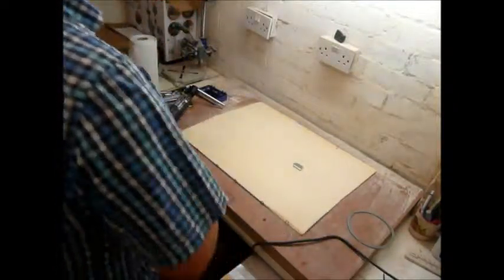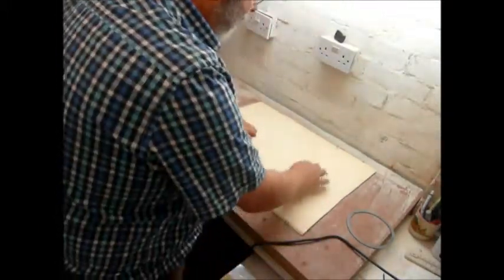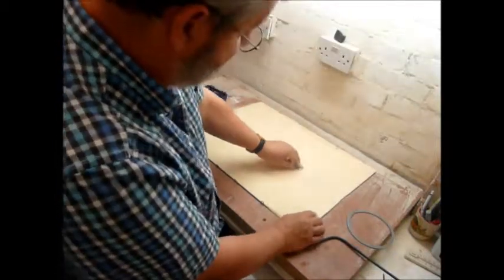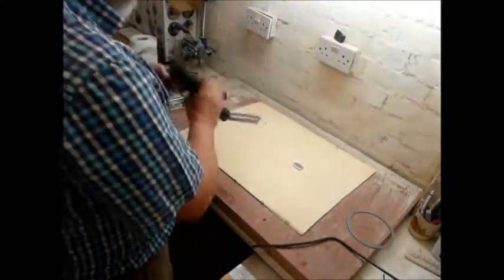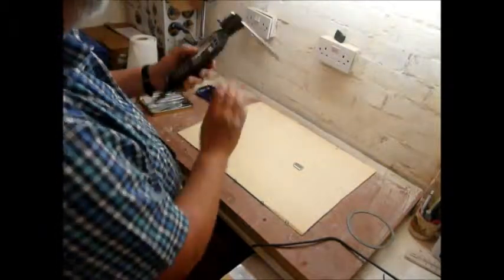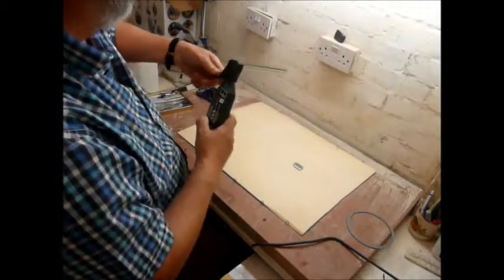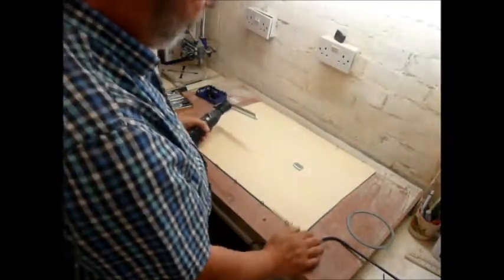Right, the way this is done is that this pivots. Okay, it swivels round on there. Now bear in mind, it doesn't matter about this piece of wood because that's being thrown away. So it doesn't matter if this marks it or anything like that, but that is on a central little pin that's nailed basically straight through the soundboard into the work surface underneath. So that's actually the anchor point. This fits on here. There's a cutting blade on there, if you can see that. That's a little router. And the idea is it will cut a channel. Trouble is, when you switch these things on, they vibrate a lot, an awful lot. So it's important to keep everything as tight as you can, but still leave the free movement so it will actually cut the circle. It's not a job that I think anybody relishes because it's so easy to make a mistake.